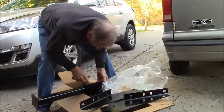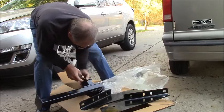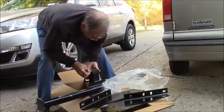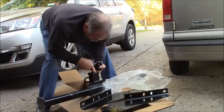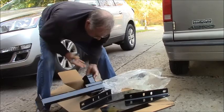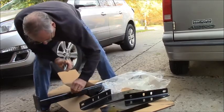One thing I'll tell you: if you're going to cap these receiver tubes, pack them inside with grease. Because if you pull the drawbar out next year, the tube can get so swollen full of rust that you can't even get your receiver drawbar assembly back in there.